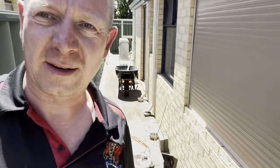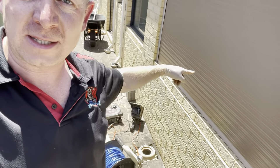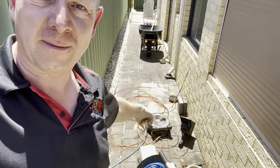As you can see, rather than just plunge a drain and think it's clear, use the equipment that's in the van. CCTV identifies that the waste pipe is also full of fat, and use the jetter and CCTV combined so that we can guarantee that we're clear all the way from the sink, all the way to the gully, and then from the gully into the main.